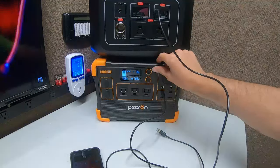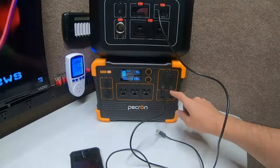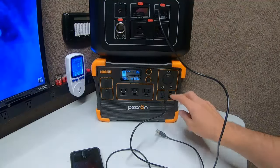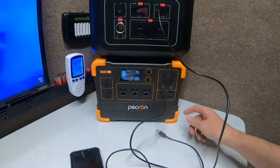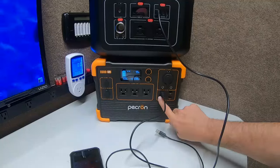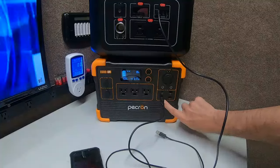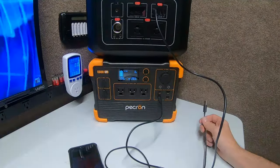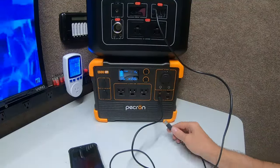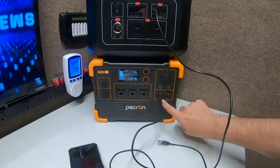So obviously there's some kind of protocol problem, or it was designed to work a certain way. I don't know, but this should come out at 100, this should come out at 18, this should come out at 18, and that should come out at 18 — but this one actually comes out at 26. I'll switch to the 18-volt out and you actually get more than 18. I've tried it on a few occasions.